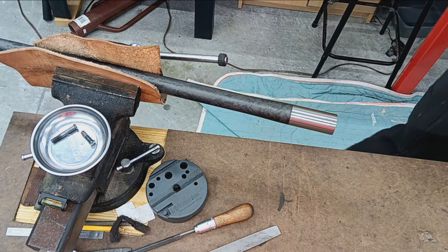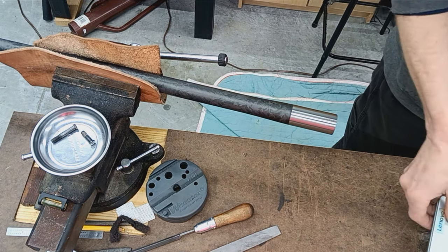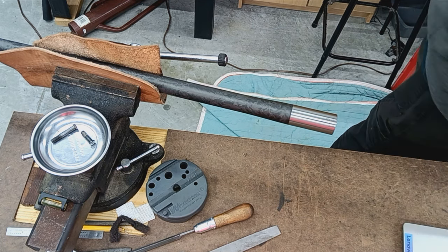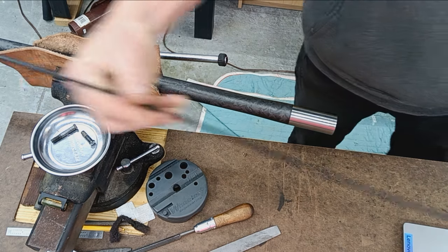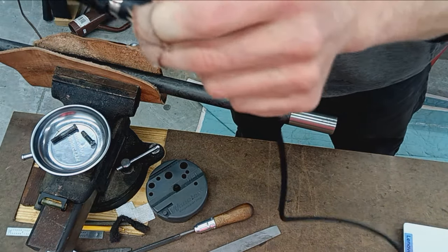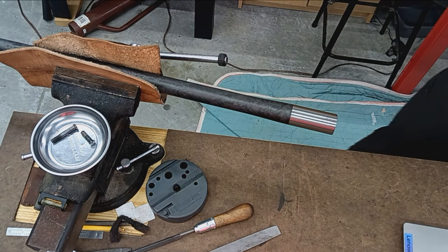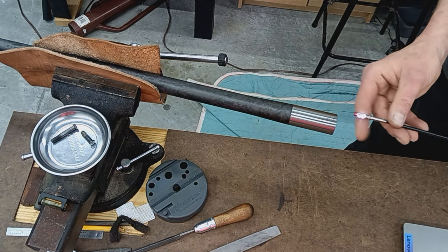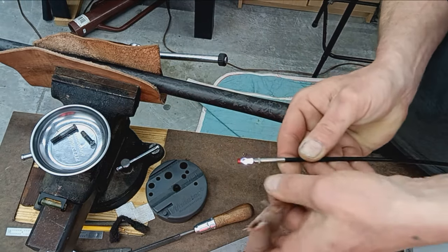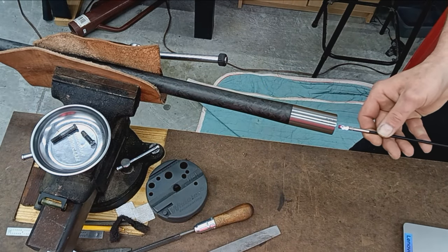And then I got my borescope. Mine's a digital borescope. It works with a laptop or a cell phone or a tablet, basically just a USB camera on a flexible shaft. It's made by Teslong. Plenty of length, and then you've got your USB adapter here that plugs into your device. Basically, it's a 45 degree angled mirror. There's a camera that shoots forward, and then the mirror helps it see the walls of the bore, which you will see momentarily here.